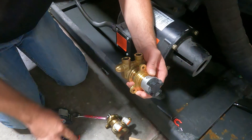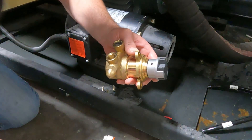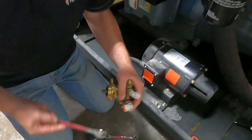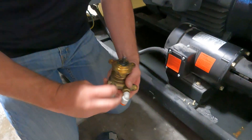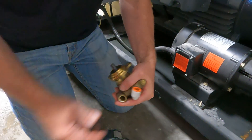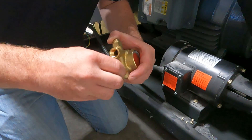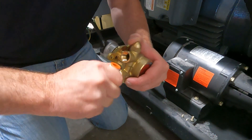Double check your distance and lock off your set screw. Take the plugs out and lock off the set screw. Make sure we swap over our fittings here. Yours may be looking rough — you can put some Teflon tape on your fittings as well.